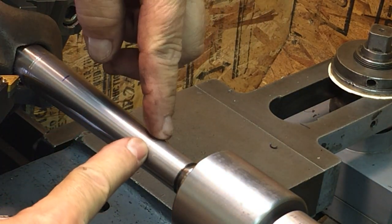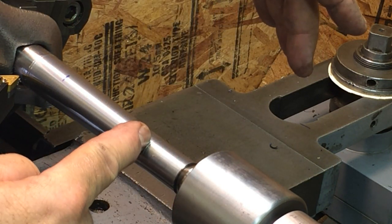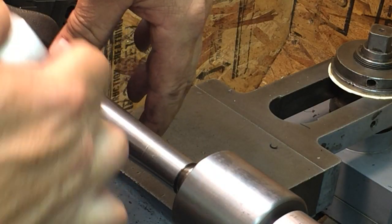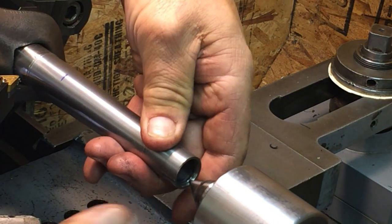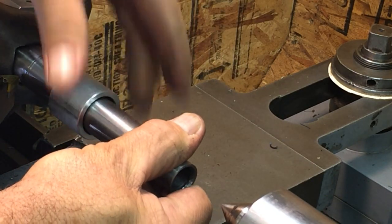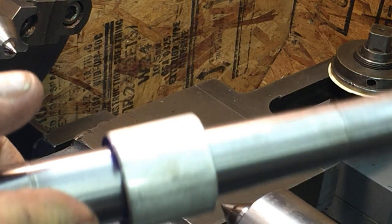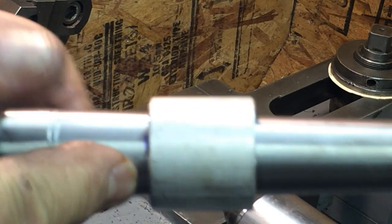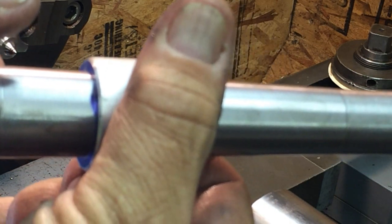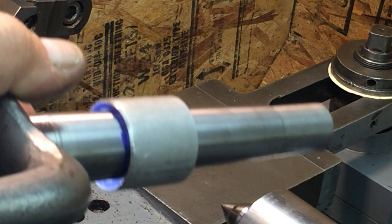All right, I just measured this lower end. We're at .790. It's an approximate measurement because you can't be right on the edge. .784 is the number there, and there's my mark for the 3 1/16 roughly. Let's see where we are. I would say we are there. I think I'm probably going to stop. It's right on the mark. So I think I'm going to call it good on the taper.